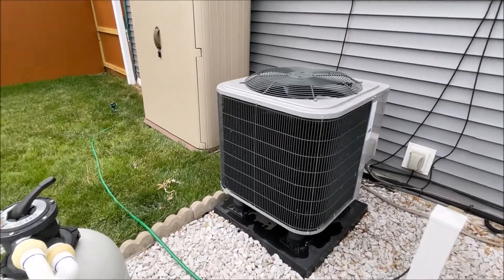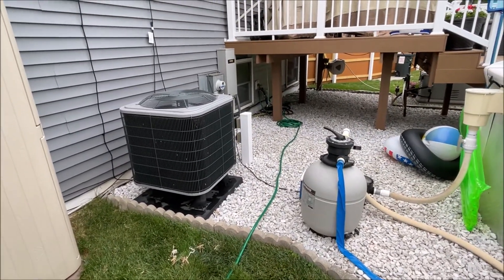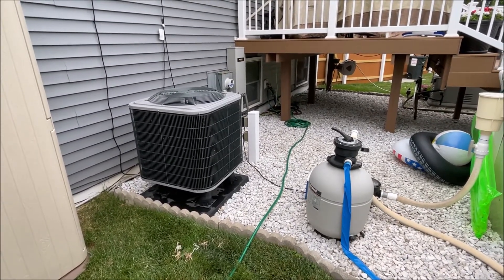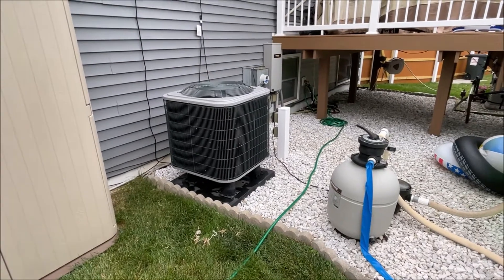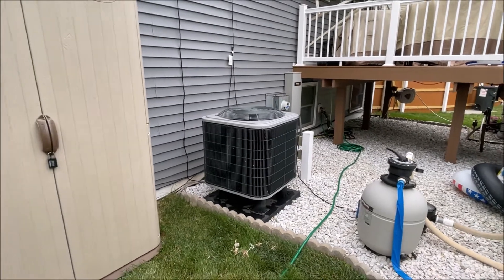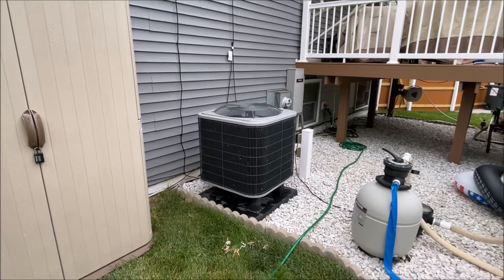Another piece of it is when they sized it, he said the three-ton unit was way too big — whoever put that in had no clue what they were doing. Two and a half ton is fine; this house is about 1,000 to 1,100 square feet. It didn't seem like it because I had maybe six inches of insulation in the attic — actual pink shredded from back in the 70s. So I had a company come out; they put about 12 to 13 inches of cellulose up there. Last week it was 85-90 degrees, very hot and very humid, and it was so nice in the house — I could tell a huge difference just from the insulation.